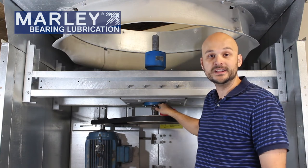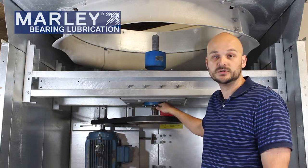That bearing is set up to be greased regularly — once every three months or quarterly is the preferred time frame to lubricate this bottom most bearing. In conclusion, it is recommended to always follow the user manual guidelines or recommendations for the specific cooling tower and bearing housing or pillow block bearing type that you may have. Again, this has been Proper Lubrication of Bearings with Jerome Jennings. Thanks for watching.